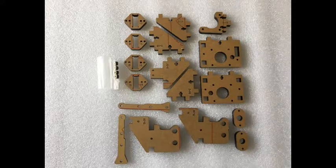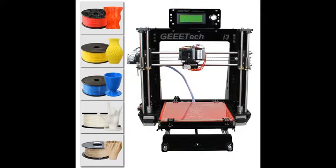It does have some metal components that typically you would see 3D-printed in other printers. The X gantry — both sides — are bent metal instead of 3D printed, which is nice. They are painted black, and the paint has a tendency to get inside some of the nooks and crannies. They include a file in case you need to open up a hole a little bit, which we had to do pretty substantially — we couldn't push our linear rods through otherwise.